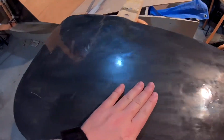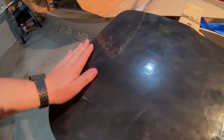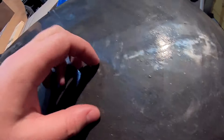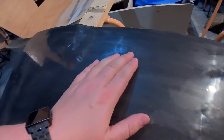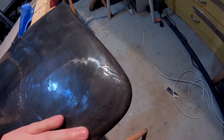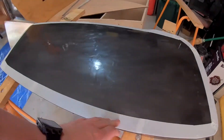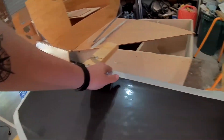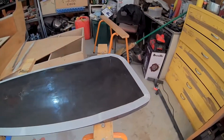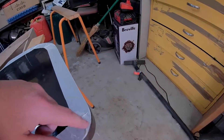It's so smooth. Got my nail in there to indicate the rotation point. There is a little bit of roughness on the surface — kind of little dots of probably dust. But it's real nice. Put some masking tape along the edge on the finished side so that when we turn it over and paint epoxy on the other side, hopefully the drips won't form on this edge and then we'd have to sand them down again.